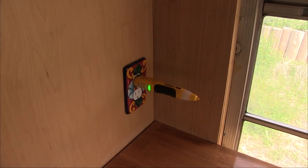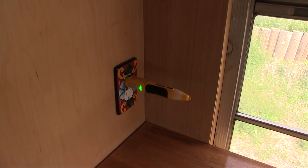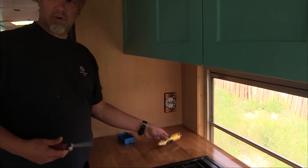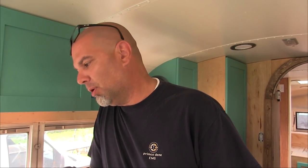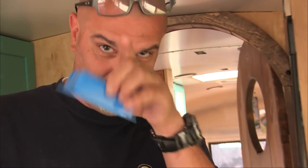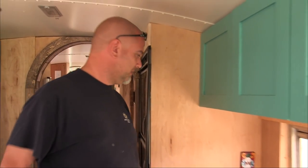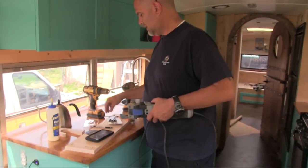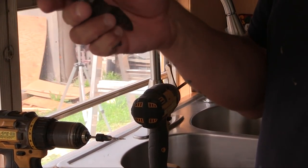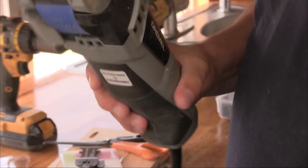Special thanks to Ray Depold, Paul Fillion, and Jason 328D who called me out on my laziness and told me I should put electrical boxes with my plugs. So this is for you guys — thank you. There are five different places I'm putting these in. We're taking off the current outlet cover and putting on one of these new ones we bought today — $27 worth. These are dual metal ones — they'll cut a nail if needed. Carrie was making fun of me when I bought this oscillating tool, asking what I was going to use it for. Turns out we've been using it constantly to cut so many different types of holes.